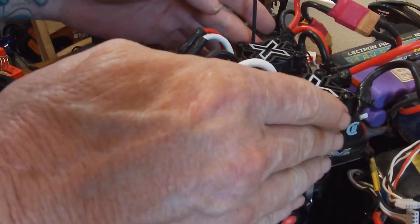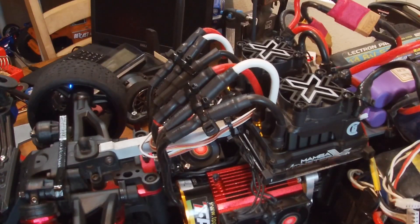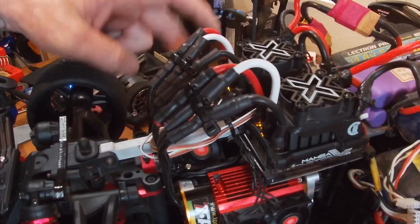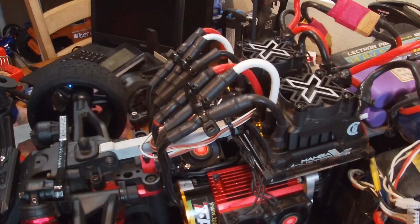Basically in the controller I was able to fix the ESCs having issues. Now I'm going to run it. I'm pretty sure they're not fighting each other now, at least according to what I was seeing on the graph. I'm going to double-check some settings in the ESC. Voltage out — I thought I set them to 6 volts for the steering servo, but it's putting out 5.9V, so maybe I should up it to 6 or 6.5.